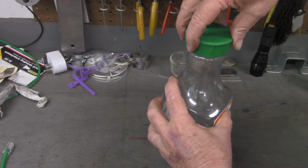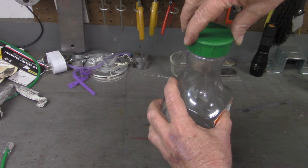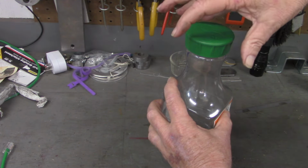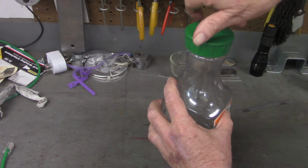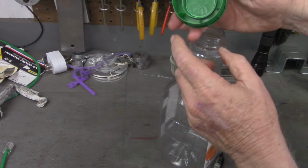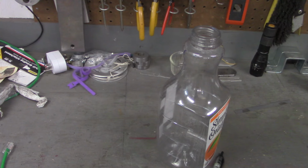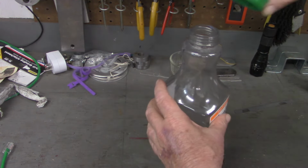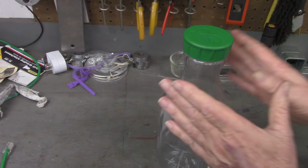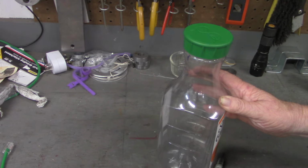Well, there's a machine that does this. And if it can tighten that lid down in 1/3 of the amount of machine operation, then that's 3 times the life of that machine. It's doing 1/3 the work as it would if it was a single start thread. Now the mold to make that external thread and that internal thread is only 1 time. Whereas when we're cutting them on a lathe, multi-start threads is a little bit more involved than just a mold. But in my mind, that's the reasoning behind why so many manufactured items that go down assembly line have multi-start threads on them.